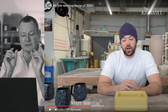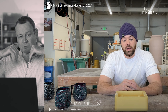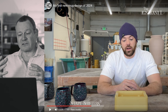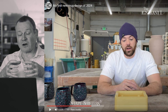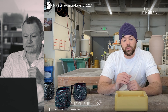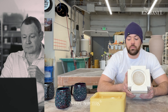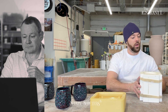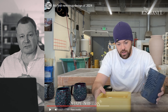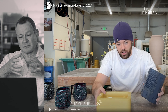But the weight of wet plaster is significant. If you look at the sidewalls of his yellow mold — at a certain thickness, when he pours plaster in, the plaster creates pressure and what we call 'bagging' occurs — it pushes the sides of the mold wall out, creating distorted edges. In molds with many pieces that go together like his, those edges are actually registration points. If his master mold warps, his plaster mold pieces will not fit together well.